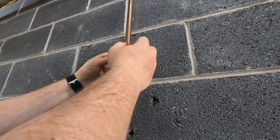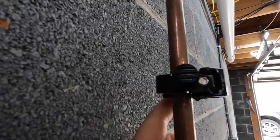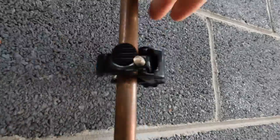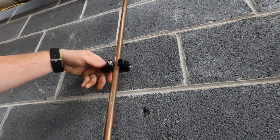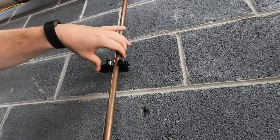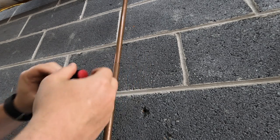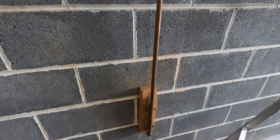This water line is a half-inch copper pipe so I'll be using my Husky copper tubing cutter. These little gizmos can be adjusted to cut different diameters, with this one cutting up to one and one-eighth inch pipe. The way you use this tool is you tighten it down so the cutters come in contact with the pipe, rotate it a few turns, then tighten again, and so on. Don't over-tighten too soon or you could bend the pipe or damage the tool.